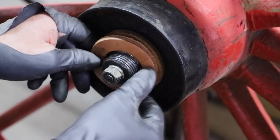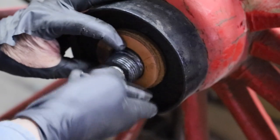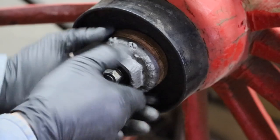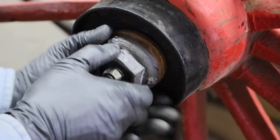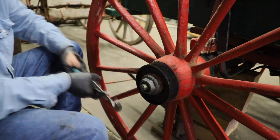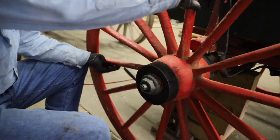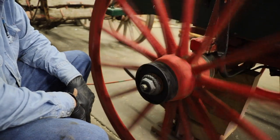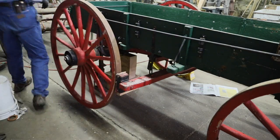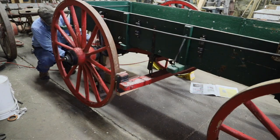Well, without really an in-depth surgical operation, there's just really no way to make this ideal. I got her down to where I'm about 1 thread or 1.5 threads short of getting the whole nut on. Still takes 2 washers to take all the play in and out. But with the leather washers, as opposed to all those steel washers, it won't have a tendency to loosen that nut up quite so bad when you're backing up.